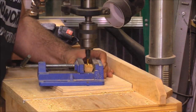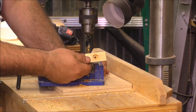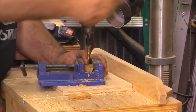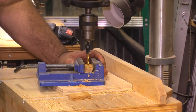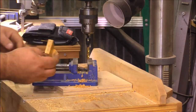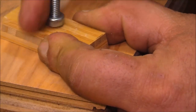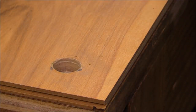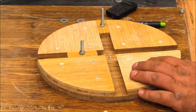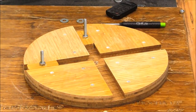I want to add some bolts to these slides, so I'm using the quarter-inch counter bore from my Izzy kit. This fits perfectly for quarter-inch carriage bolts so the head of the carriage bolt will sit below the surface of the material. With those installed I tighten the nuts down to keep everything secure in the slides, then I come back and double-check that everything is sliding like it's supposed to.